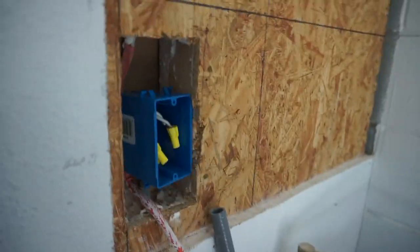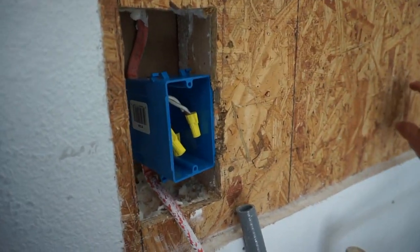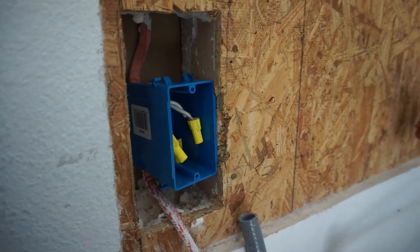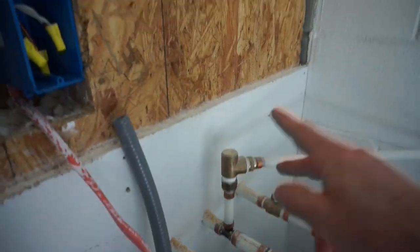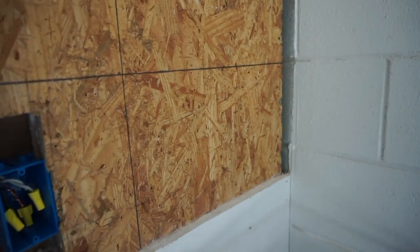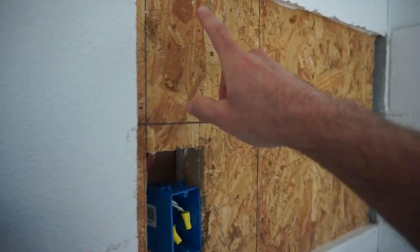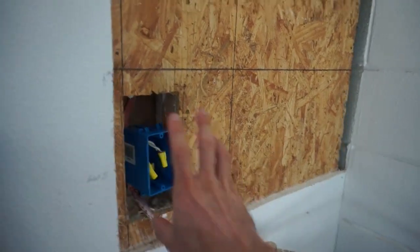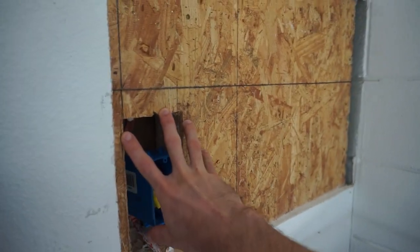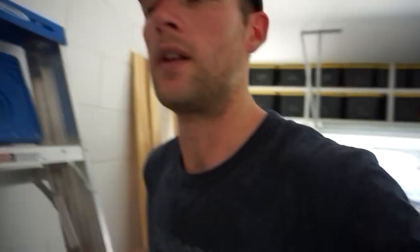What I think I'm going to do is take my multi-tool and just cut out a strip down through here and figure out what's over here — whether that's water pipes or just some insulation — and find a spot where I can put that other outlet. Then I'll cut the half-inch plywood panel to fill this gap, make sure this one's covered, and I might put a little label there showing what's behind there.